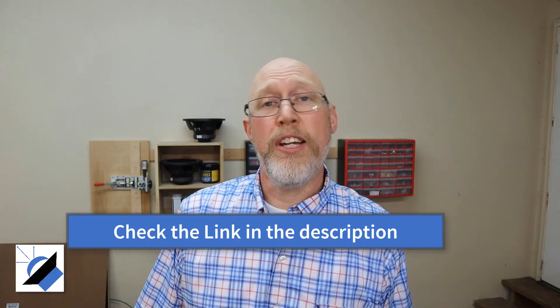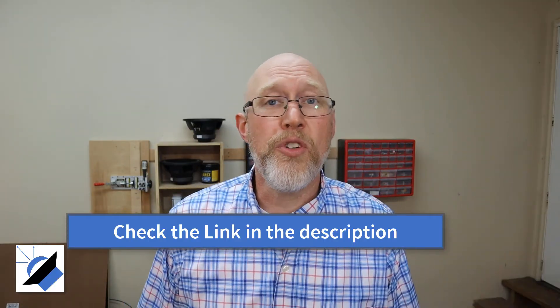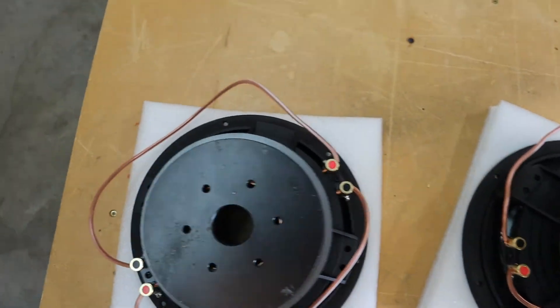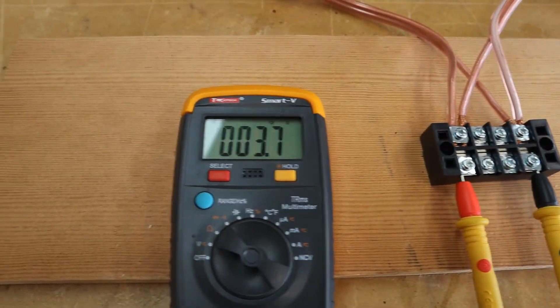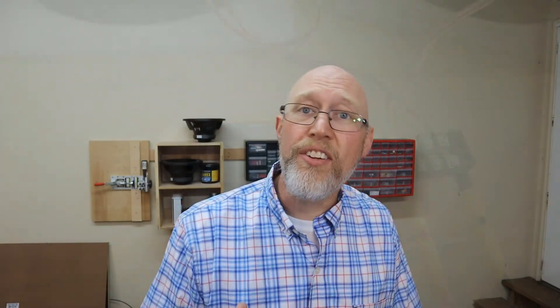If you're doing this for a living, go get a nice one like a Fluke or a Klein. But if you're just in your garage trying to get this sorted out, run down to Harbor Freight and get one for less than 10 bucks. Here I've got my voice coils wired in series and the speakers are paralleled, so I'm going to probe these ends right here and I should get a four ohm load. And I didn't get a four ohm load — in fact, you almost never get the exact number that you expect, and that's actually normal. There's a reason for this. If you'd like to learn why, and learn how AC impedance works when you put a speaker in a subwoofer enclosure, check out this video right here.